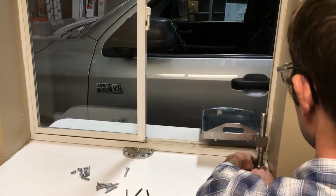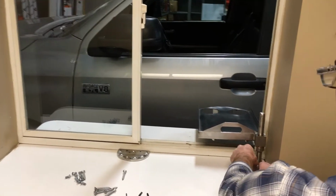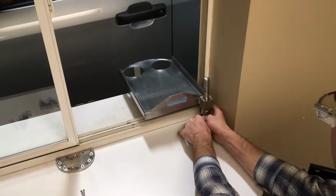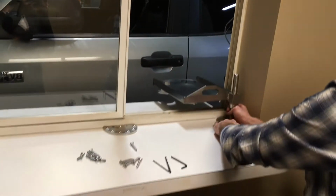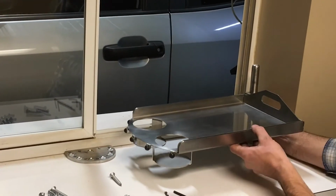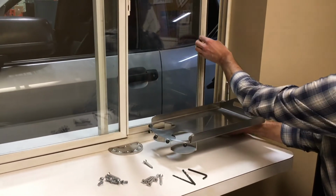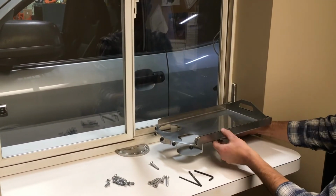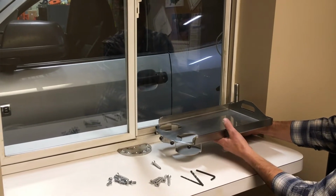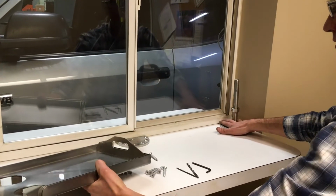With the window fully open, readjust mounting rod with the assembled tray attached to align flush with the outside opening of the window and swing the tray out towards the outside of the window. SwifTray should just touch the edge of the window frame. Rotate the tray inwards to ensure the window clears the edge of the tray once closed. Remove the tray assembly from the mounting rod without disrupting the position of the mounting rod.